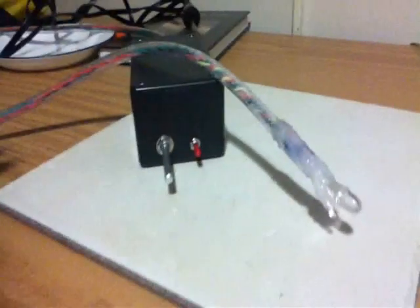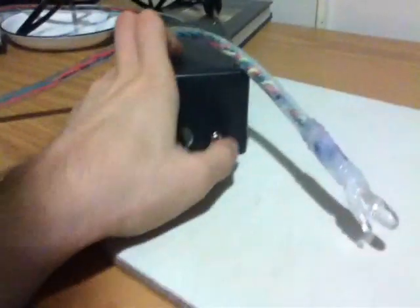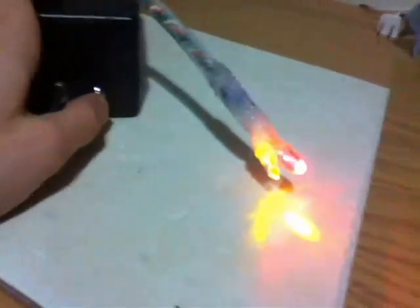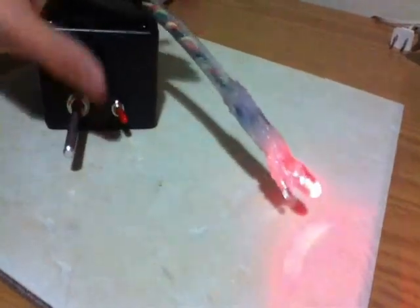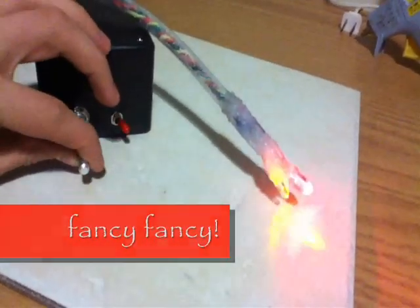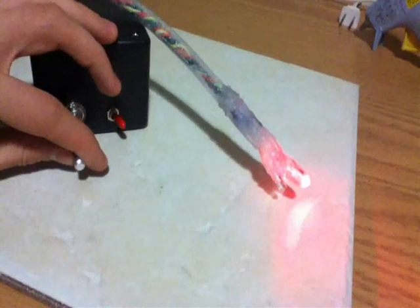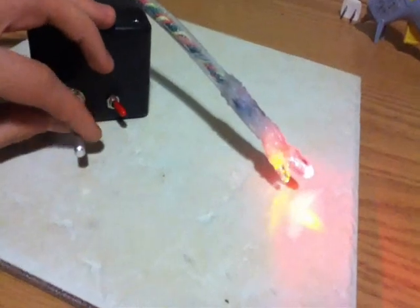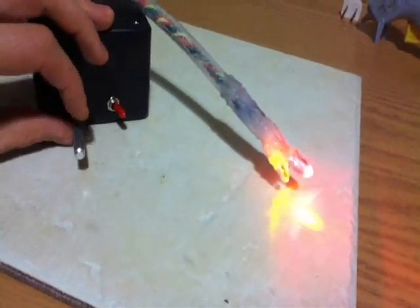What I did was I took a couple LEDs — this is one of the super bright red LEDs, and a yellow LED — and I built a circuit. Actually, I think the best way is just to show you. There's a little switch here; you can put it on full or pulse, and I can control the rate that it's pulsing at using this potentiometer, so it can go slow up to even faster until it looks like it's completely full.